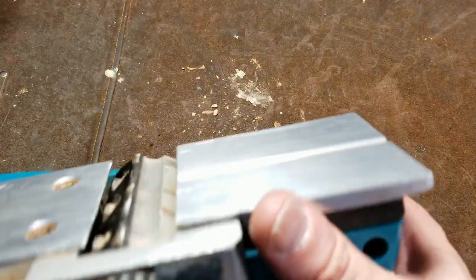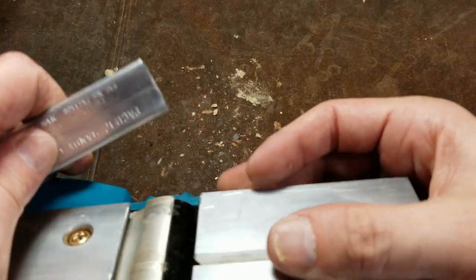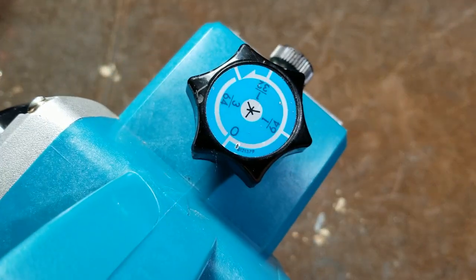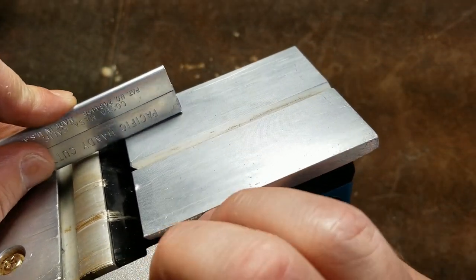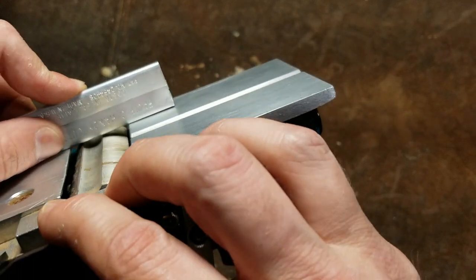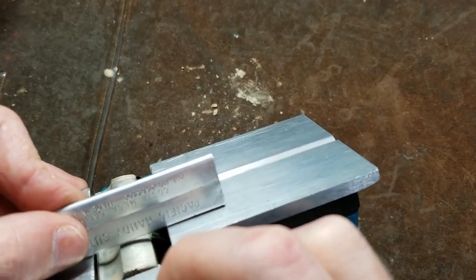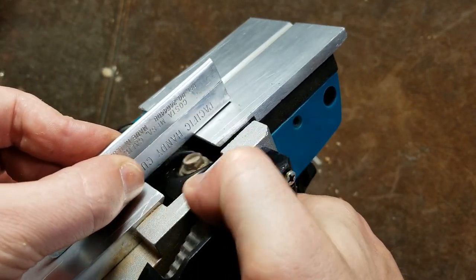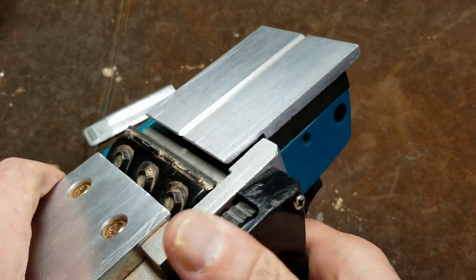Probably do a video in the future, but a quick tip for adjusting the blades is you just take something with a pretty decent straight edge. It's actually easier on the Makita because the belt's exposed, so it's really easy to spin the cutter head. But if you have the handle here at zero, there's the arrow, then you just take on both sides. You just put something on there and just see if the blade wants to catch something. So we know that we're good right here. This also allows you to look down and see how even it really is. It's actually pretty good. How about on this side? If I can get this in frame, it's a little awkward. Same deal here. It's actually pretty good. This is really a surprising result considering I'm using those old parts. I was able to grind off enough for them to seat down properly.